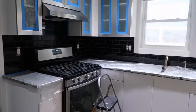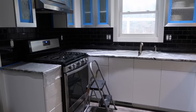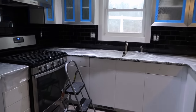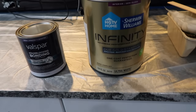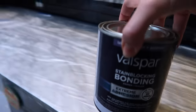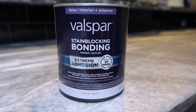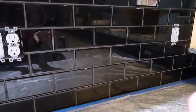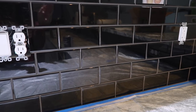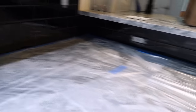I have some overhead lighting on now. I took all of the covers off the outlets — didn't realize we have a lot more outlets than I realized in here — and taped everything off, got it all protected. All of the pulls are currently in the garage. I've got a couple coats on those. This is what they suggested I use when I was at Lowe's — a primer that is ideal for tile. If you're planning on doing a project like this, look up what kind of tile you have. Some tiles you're supposed to sand; some you're not. For this one I don't really need to sand it, so I'm just going to use this primer.